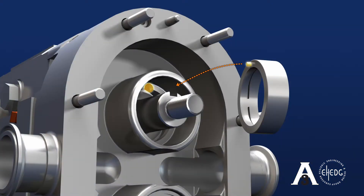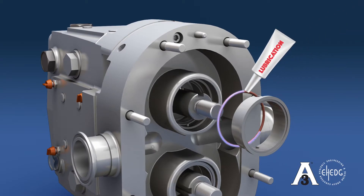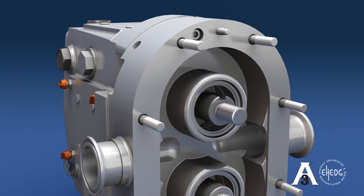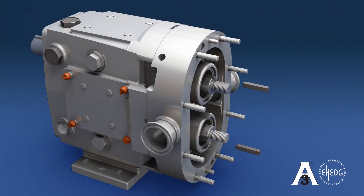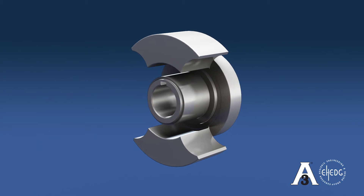Reinstall the sleeve back into the shaft bore by aligning the pin on the backside of the sleeve to the slot cutaway in the shaft bore of the body. Lubricate the O-ring and place over the seal diameter. Press in the seal by aligning seal pins to notches on the seal. Insert the rotor keys back onto the shafts — make sure the rounded end of the keys match the same keyway profile on the shafts. Reinstalling the rotating seal: lubricate the outer O-ring and place into the groove on the outer diameter of the seal. Align the notches on the seal to the drive pins of the rotor. Press the seal down, making sure the seal is completely seated.